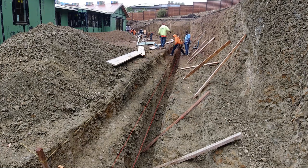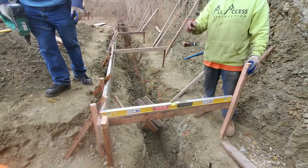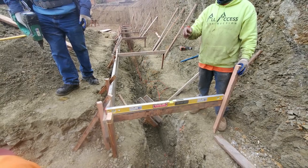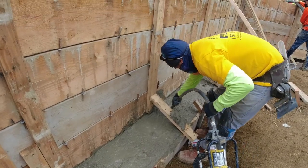Quick note: you want to make sure that your contractor or whoever's doing the excavation uses a true-to-size bucket. I believe they used a 16-inch bucket here — it was supposed to be a 12-inch bucket. It's construction, so things like this happen. In the end, I think we ended up getting a couple extra yards of concrete.